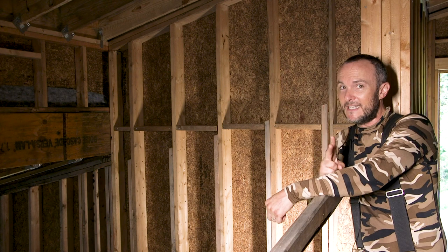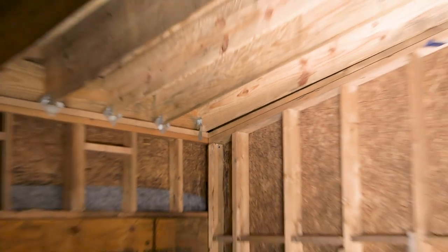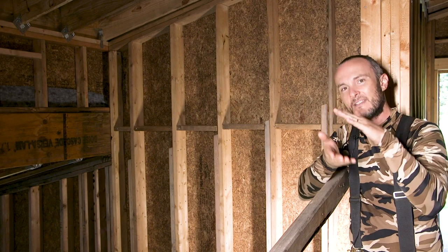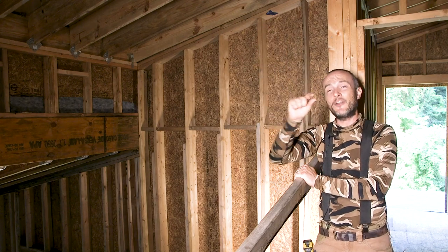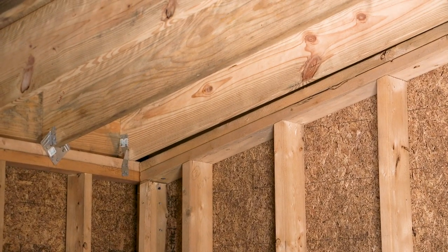The second mistake is a staging mistake, which is really funny — you wouldn't think about it unless you're a holistic, home-as-a-system thinker. That cavity up there has 16-inch cavities all along. I have R-38 insulation — an R-23 batt and an R-15 batt sandwiched together — that needs to go inside each of these 9.25-inch cavities. But that last cavity can't be stuffed because there's barely an inch and a half of access. That's not going to happen, realistically.